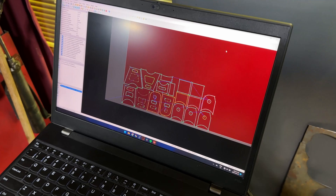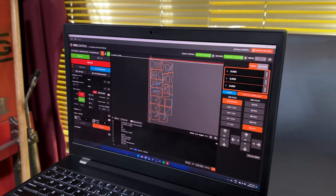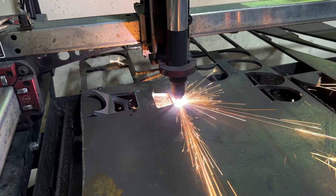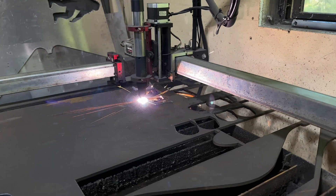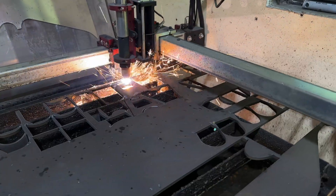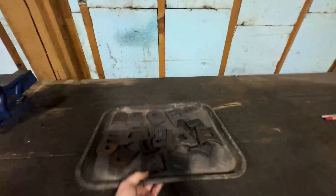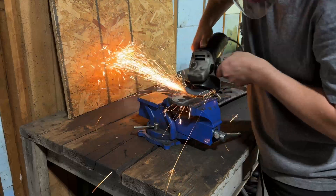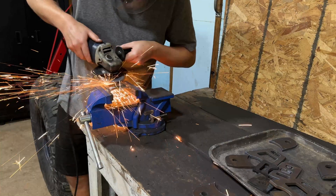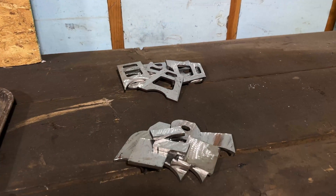It's now time to start the axle-side mounts for the front three-link. I start my designs in SolidWorks, move them into SheetCam, and do all my cutting and fire control, which is the program that goes along with my Langmuir CNC plasma table. This plasma table has been incredible — it's been very easy to use and it produces some really high-quality parts. I am doing some cleanup here to get rid of the mill scale prior to welding, but honestly the parts come off very clean off the table and I'm very impressed with it.